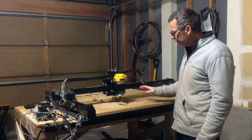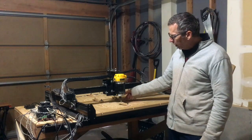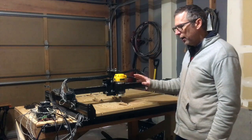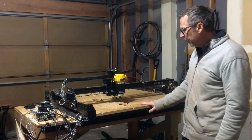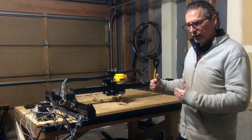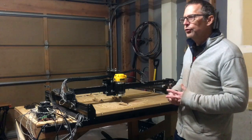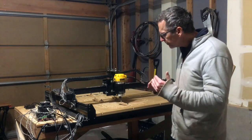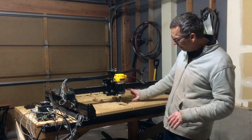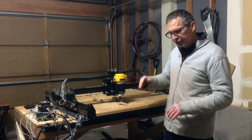The other concern is capacity. The X-Carve has about a two-and-a-half inch capacity stock out of the box, and that allows you to carve just about any solid body electric guitar body and most necks. However, if you're doing angled headstocks, you have to take into consideration how high that headstock is going to come off the table, because you don't want the gantry to bash into it.